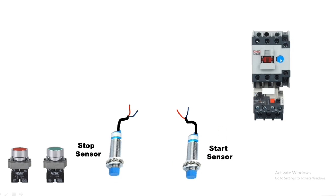In normal condition we stop our motor starter with an NC push button, so the stop sensor should be NC type. We connect the NC sensor for stopping the motor starter — it is a two-wire sensor operating at 220 volt AC. The start sensor is a NO type, because we start our motor starter with a NO push button. So we connect the second sensor which is NO type, also a two-wire sensor operating at 220 volt AC.